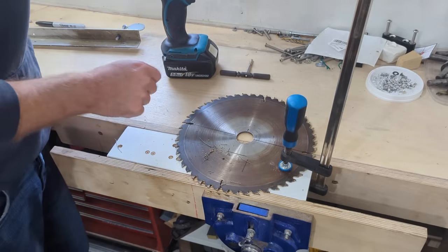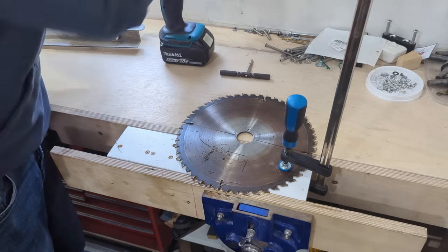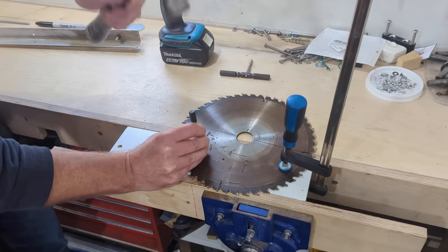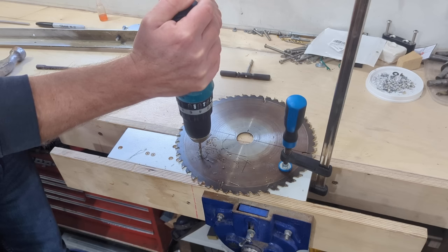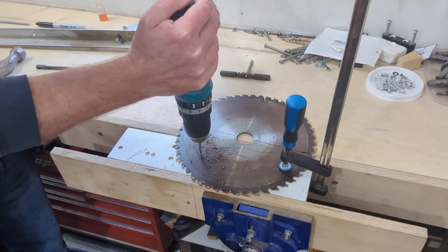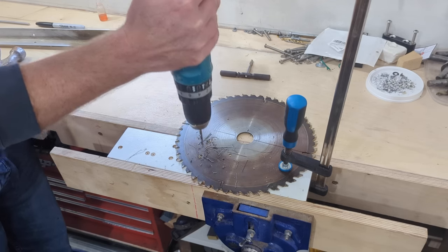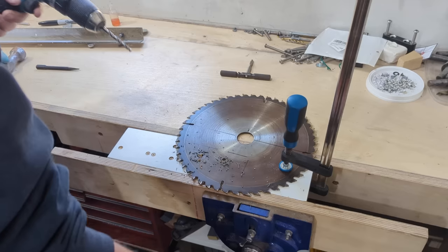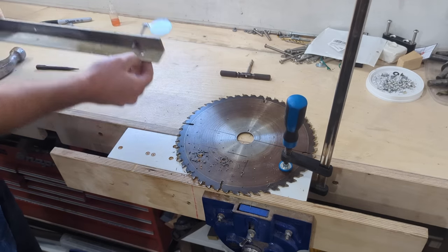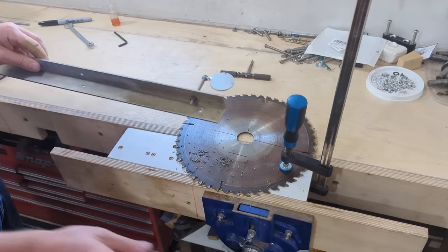What I'm going to do then, I'm just going to add another little hole a bit further down. What have I just done with my centre punch? Little bit of lube. That drilled lovely. Right, I'm going to open those out to 6mm. Right, perfect. Just going to open up the holes in here. We'll offer it up. We'll bolt the first one on, and then we'll use this as the reference point to put the second hole in and bolt it all together.